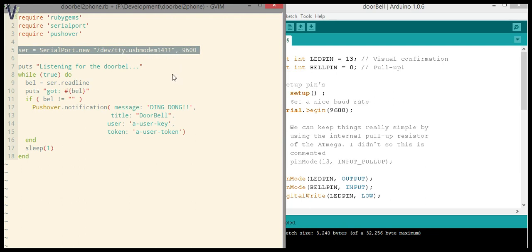That is going to be different for your use case. It won't be the same. So you just have to find out on which COM port your Arduino is broadcasting. In my case, it's COM3. That's very specific to Windows. You might be using Linux. You might be using OS X. Names differ, methods differ. This line is going to look different for your case. So find out how to connect to the right serial port for your specific OS.